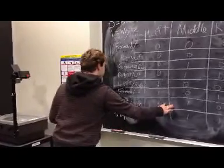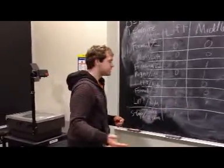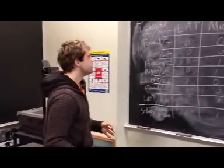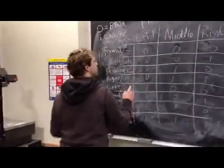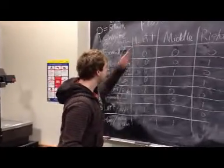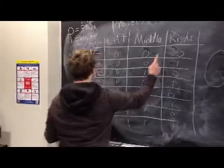Similarly, on this side, if we sense the tape with the left sensor and the middle sensor, we turn right fast as well. Milder turns can be seen when we sense it only with the right sensor or only with the left sensor. In this case, it simply turns right to avoid the tape on its left, or it turns left to avoid the tape on its right.